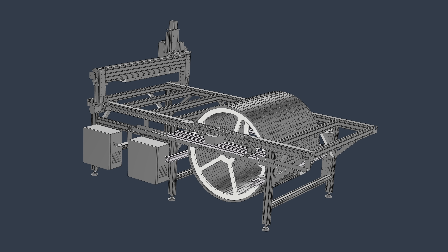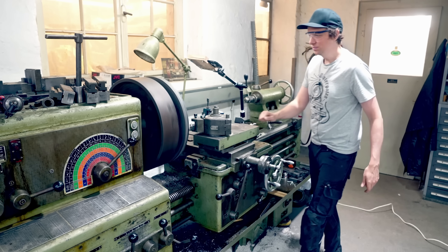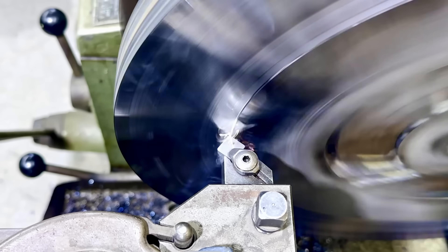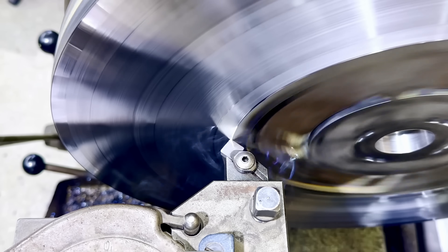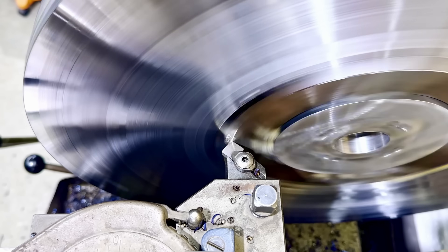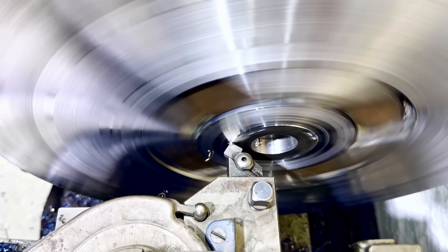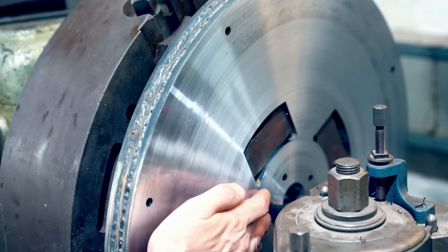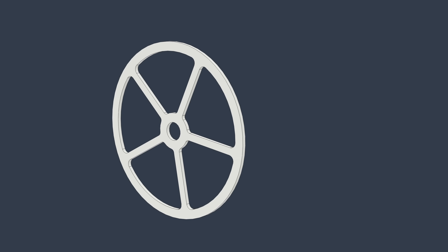Version 3 is using a rotary CNC machine again, and in general I think I should use rotary machining for most rotating objects on the marble machine. I'm used to only having access to 2D machining tools, so I've been stuck in that mindset and avoiding designing things for rotary machining. I need to get out of my 2D comfort zone and start designing for turning and rotary CNC — the precision is just on a different level with rotary machining.